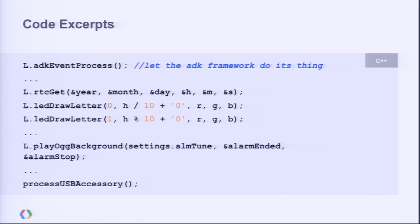So please do. And so just to go back to that, the multitasking thing sounds complicated. Like, do I really have to worry about that, or is it as simple as making that function call every once in a while? So if you don't want to play around with multitasking, you just make that function call and everything works. If you want to, you can play around with the multitasking, and it's actually very simple. There's 2 functions really if you care about, one to launch a thread and one to yield. And the thread dies just whenever you return from that function. So if you want to use it, go ahead. It is in the code.